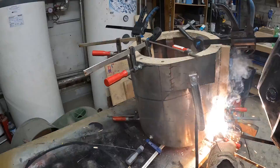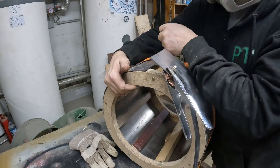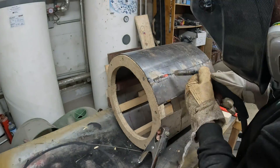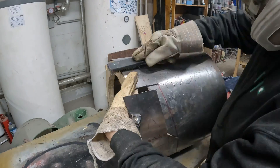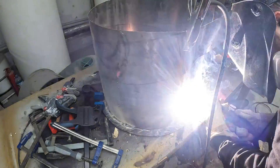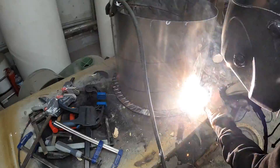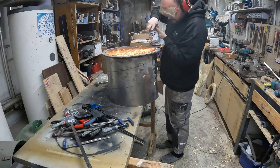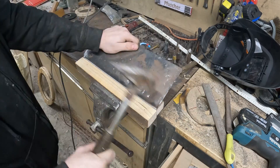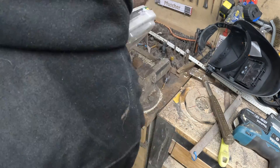Afterwards it was time for my welding machine again. I started to spot weld the ends so that the cylinder would stay in shape without being clamped, then I used a tensioning strap for the remaining weld seams. Then I dismantled the inner wooden body by loosening the screws with my cordless screwdriver. Afterwards I welded the second larger circle to the lower side of the cylinder. Now the angle grinder takes the spotlight — with it I sanded down the weld seams a little. On to the next act, where metal sheets transformed into a square pipe.